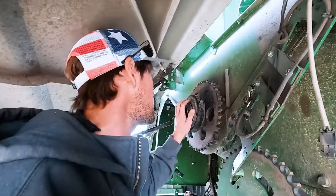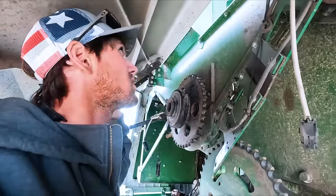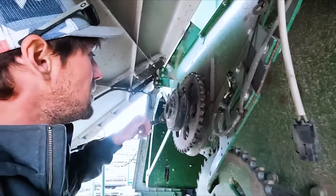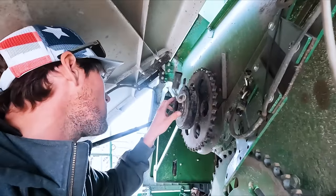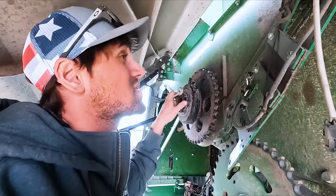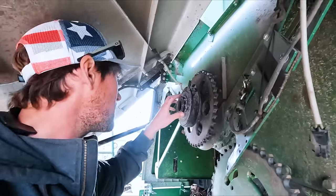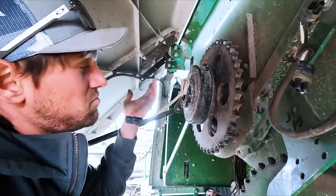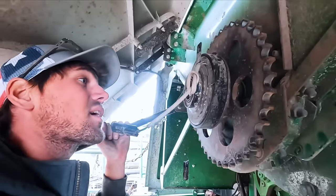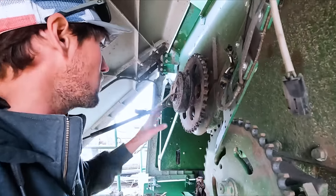I love these because with two corn combines, carts get full. It's nice to shut off and your unload auger system shuts off. But I've burnt these enough times that I think they're now shot. The 28% corn did not work with these. Then I slipped them, and now I got into some 20% down in that low bottom on Eric's, and she won't unload, or very well could be some part that we forgot in the combine, which I don't think so, but who's to know.